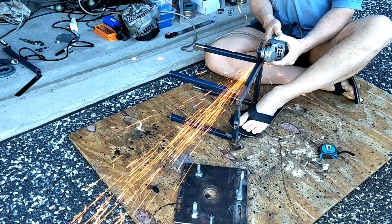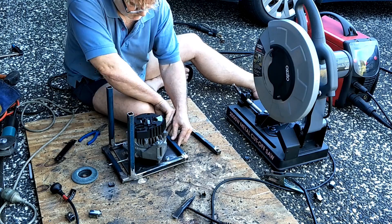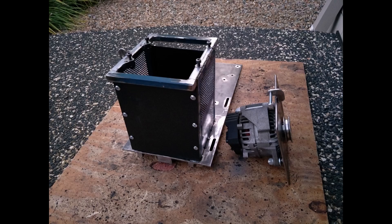Then I had this brilliant epiphany to move the alternator stand legs backwards of the studs, so I chopped off the alternator stand legs and moved them. I even went as far as making sure the alternator had full movement. Now take a look at this picture again and see if my fuck-up becomes obvious — yes, when I moved the legs and welded on the plate, I also reduced my alternator travel.